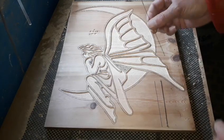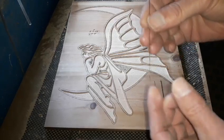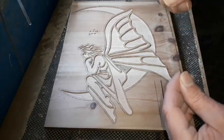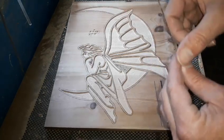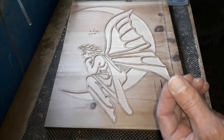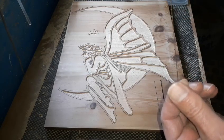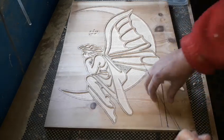The blade I'm going to use today is what they call a spiral blade. These are pinless. I love these spiral blades. You will either love them or hate them. They're going the same way as your standard blade, so smooth on the way down, rough on the way up. But the blades are spiraled, so the teeth go all the way around the blade itself, should I say.